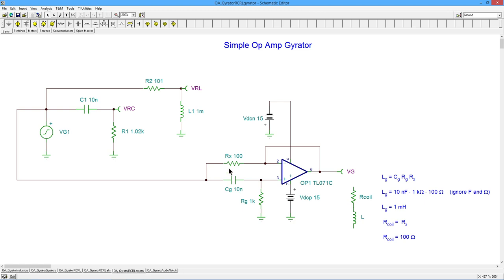So the other path that we have into the op amp is through this resistor, right? This RX resistor, the mystery resistor. And there is a direct feedback, a simple wire going from the output back to pin 2. Now, one thing we know about the op amp is the differential input voltage, if everything's operating correctly, should be 0 or darn close to it, right? The op amp tries to hold that differential input, the error voltage as we sometimes call it, at 0. So the voltage from here to here, if you put a meter across here, right, should be pretty darn close to 0.